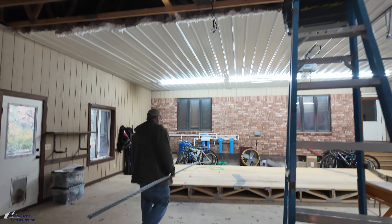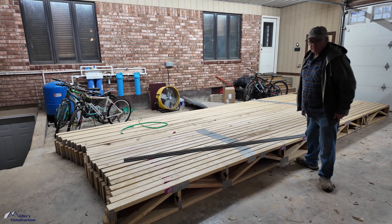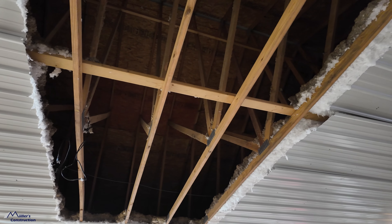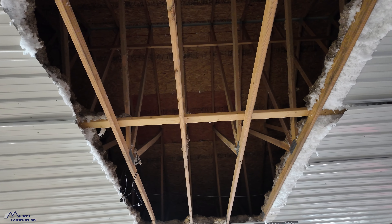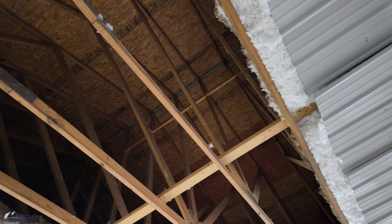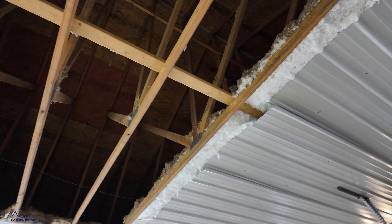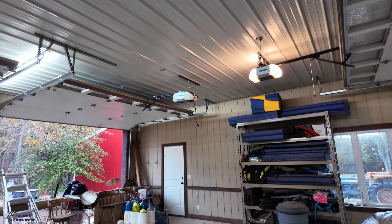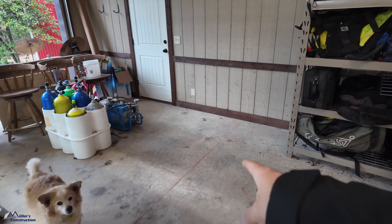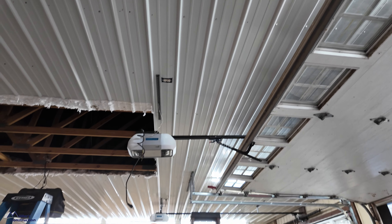We're hoping — and we don't know if this is going to work 100% foolproof yet — but we're hoping to fit these floor trusses up through the one hole we've cut out, roughly a little over six feet. Hopefully we can get a few of them in, cut our webbing out, and carry on with the next trusses to get ourselves a deck up there to stand on. But right now our main focus is to get our posts set. We've got a chalk line, a reference line, for where we're going to set the beam. Let's get going.